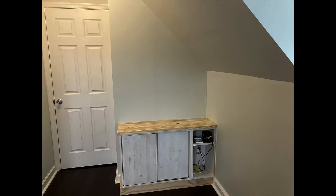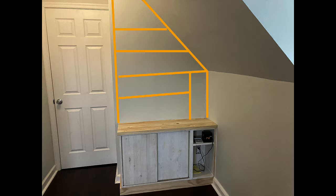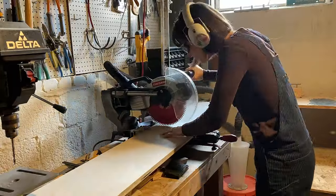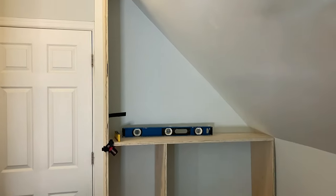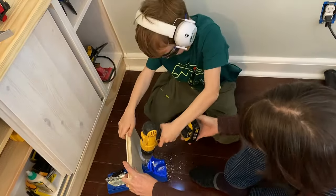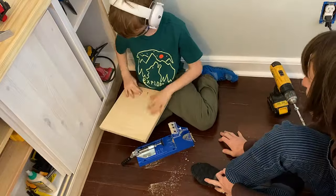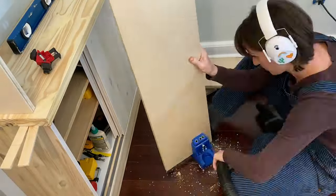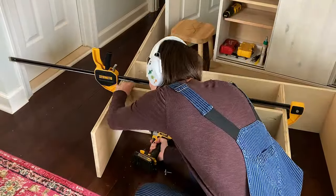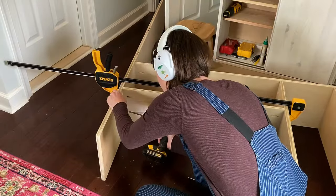Now for the hard part — the angled bookshelf. My idea was to start by constructing a box the height of the point where the wall and slope meet, with the other side extending to the ceiling and a divider in the middle, then add the angled piece and angled shelving later. I ripped down three-quarters inch cabinet grade plywood and cut all my pieces for the first part of the box. I used a clamp to do a dry fit just to make sure my plan would work — so far, so good. And now for a whole bunch of pocket holes. Pocket holes work great for shelving; they're a bit tedious, but for me it's the best way to join 90-degree corners. With the last screws in, the first part was done.